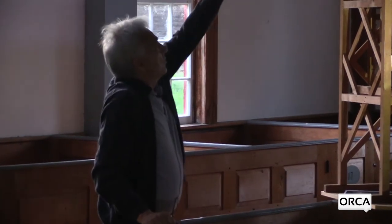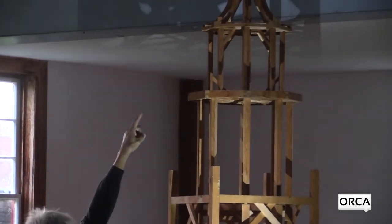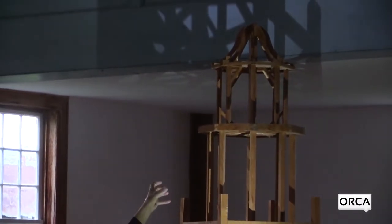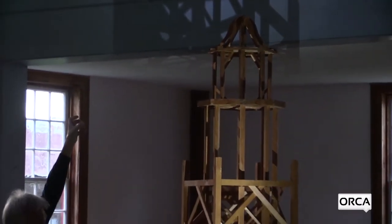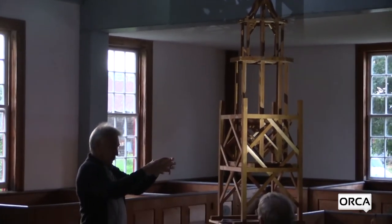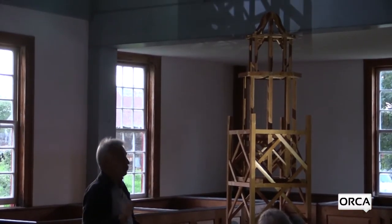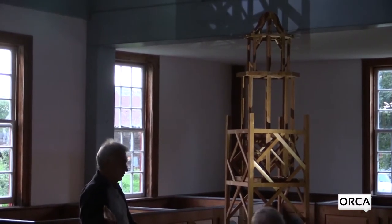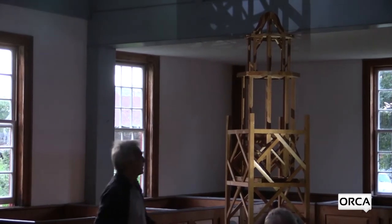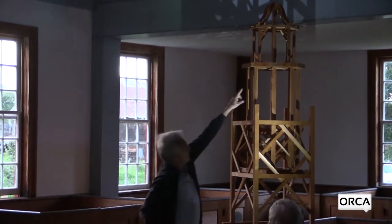But anyhow, you've got a mast that comes way down in yours, but it's rotted at the very top, and it's hollow for quite a ways. The part that's been put above it, which is probably a nice replacement, is just attached to the tops of some small rafters. It's not a good attachment. You will have trouble there one of these years, one of these days. I can't say when.